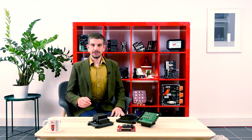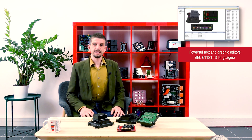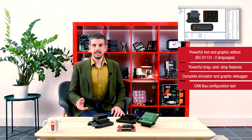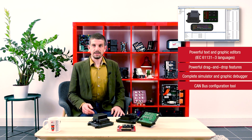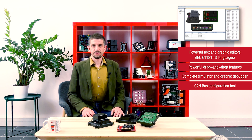With this new product generation — as the CANBOX 8FS6 is only the first of its kind — we are also introducing a new programming environment offering much more possibilities compared to our current one. This new programming environment is called WE-Control Designer and is an IEC 61131-3 based software, offering ladder, function block diagram, and structured text as programming languages. You will also have a complete simulation and live debugging capability. We will dedicate a tech talk to this programming environment to present in more detail the many features and how this software helps you get things done.